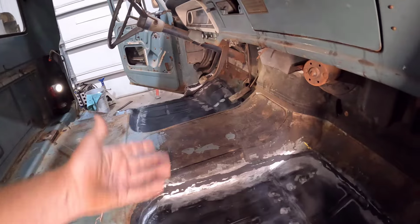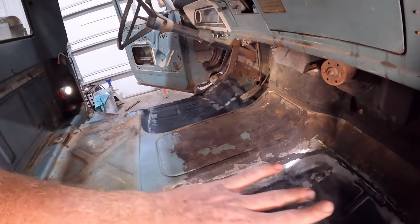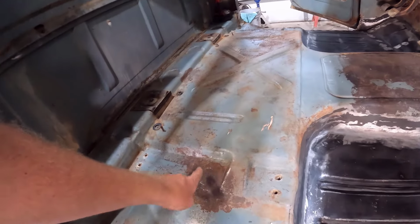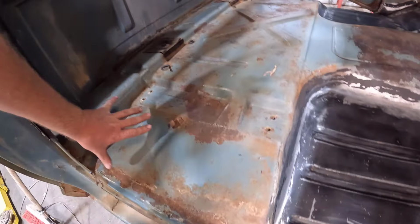I'm guessing it's some kind of sound deadener that the factory put in. I'm not going to scrape all that off because it's a pain and there's no rust under that stuff, so I'm not going to worry about it. I'm just going to paint the floor pans, all the bare metal, and I'm also going to do under the seat here where this rust is, where the paint's kind of flaking off. I'm going to get all that coated so not to worry about that in the future, and especially these areas